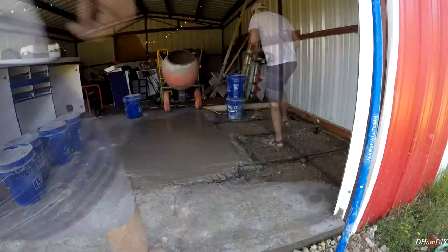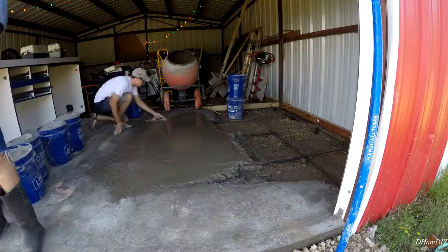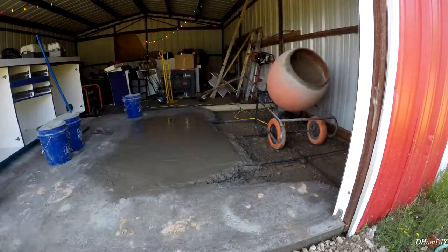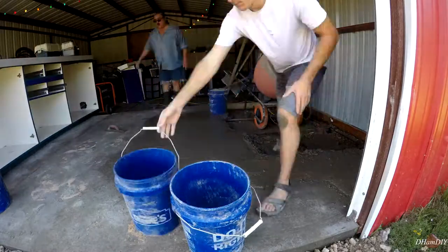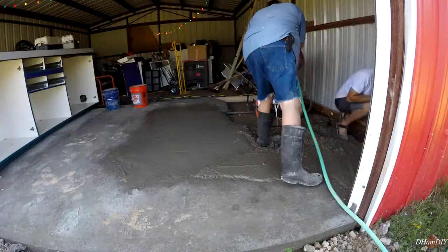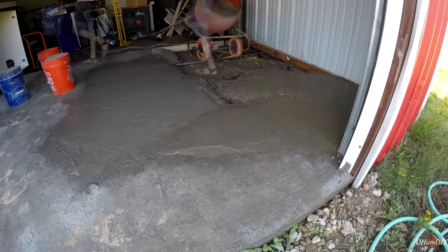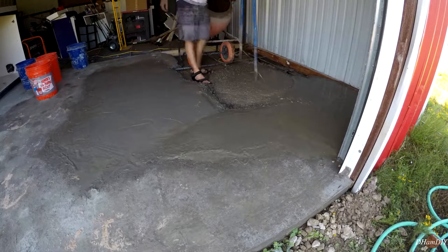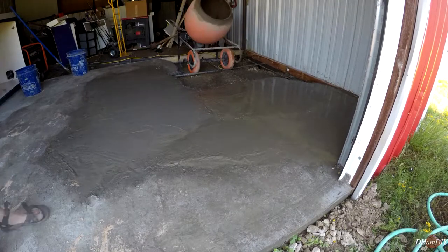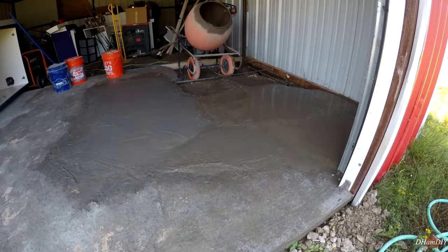When it's fully hardened you can see me trying to work the corners and get them to meet up flat. It was possible but the large rocks in the concrete made it very difficult to smooth it out with the taper as I tried to join sections together. A way to avoid that would be to end the concrete at a perfectly flat drop-off with no taper, or you could come back later with a sand and cement mortar mix, trowel it out, and get it flat. A lot of this isn't perfectly level — there are some scuffs.